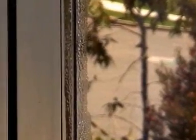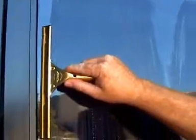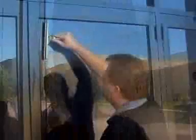Notice that when we squeegeed this window, we left some water and chemical around the frame, particularly from where we started. This happens because we put our dry squeegee onto wet glass. If we dry the edge first that we want to squeegee from, and then place our dry squeegee blade in the dry area, we will not have this problem. This can be done with a rag, but it is better to use the end of the squeegee. This is called cutting the edge.